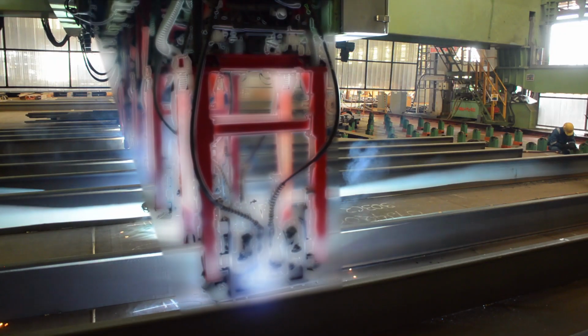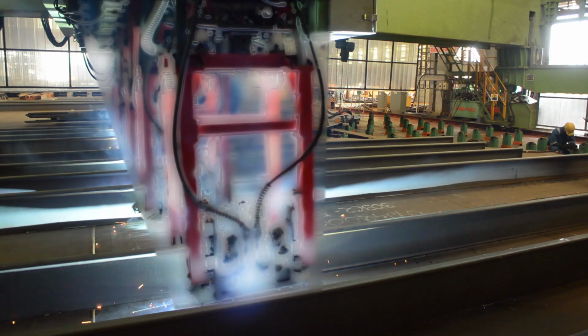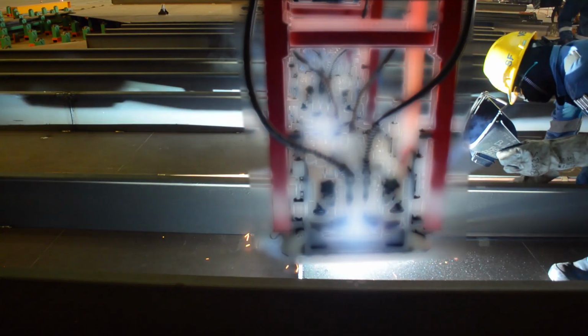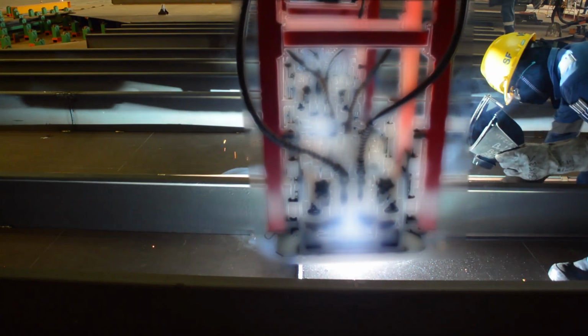Therefore, the first step is to set an appropriate range of current and voltage for the proper welding parts. For fillet welding, the torch angle can melt the root part, and 45 degrees is recommended to form a conformal fillet. At high angles, the upper leg length will be long and undercut occurs easily depending on the conditions.